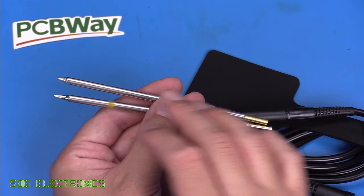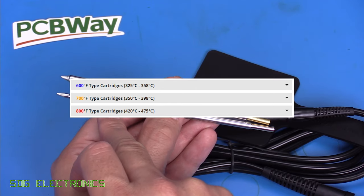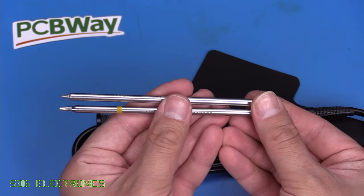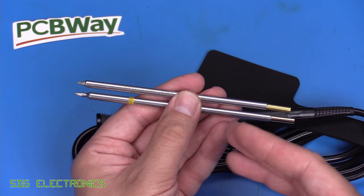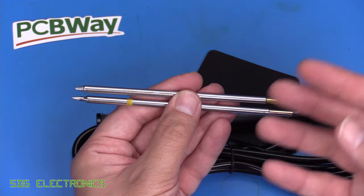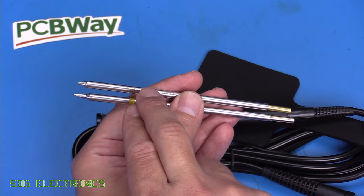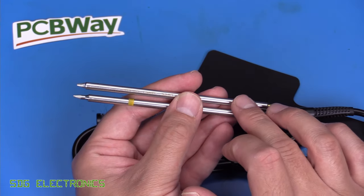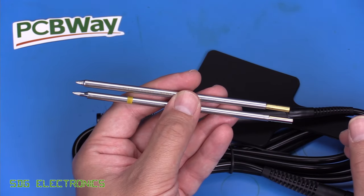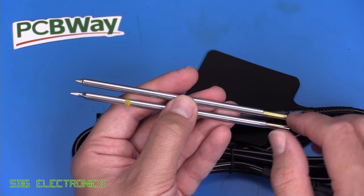Here is a Metcal and a Thermaltronics cartridge side-by-side — very similar in design. The main difference is the Thermaltronics has a colour band indicating the temperature range: red, yellow, and blue. On the Metcal you have to look at the model number. They have the same connector on the end and you can interchange cartridges between the Metcal MX system and the Thermaltronics, though not with the connection validation system which needs the chip. In terms of cost, the Metcal cartridges are often less than £25 on Farnell and last really well.